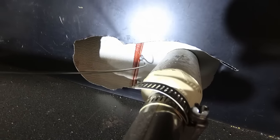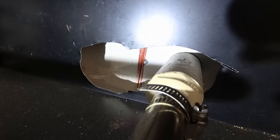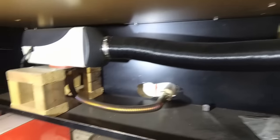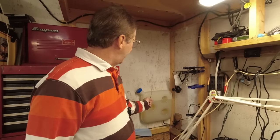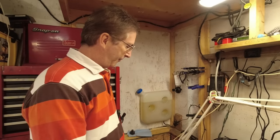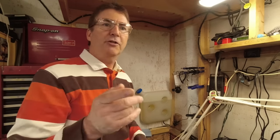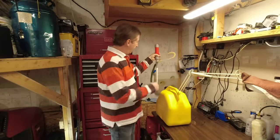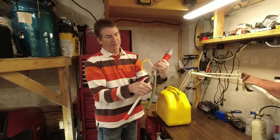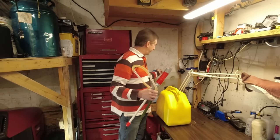The pipe goes through my door — there's another piece of metal on the outside. I drilled a four-inch hole, and around the door is rock wool insulation. The inlet is here, the outlet goes through the door. My diesel tank is mounted to the wall, and I use an electric pump because it's too awkward to reach in. I added a small piece of silicone hose to the end to reach the tank so I'm not reaching all the way over to fill it.